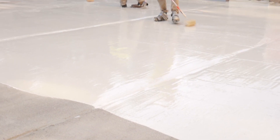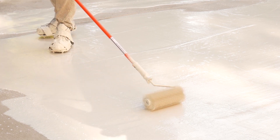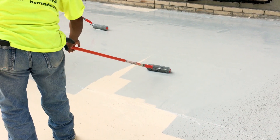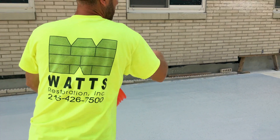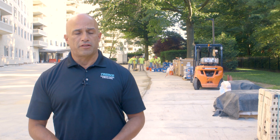After that we're able to put the base coat at 80 mils with no aggregate, and on top of that we'll put the top coat with heavy-duty aggregate so that the asphalt being installed on top can bond to the top coat of the TREM-PUR PUMA system.